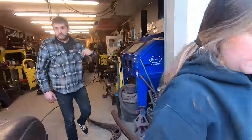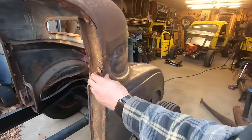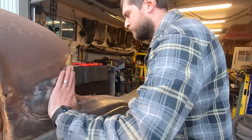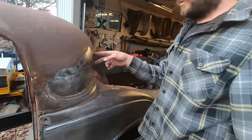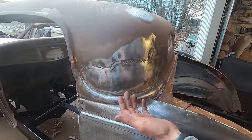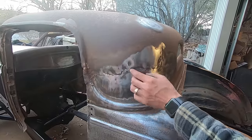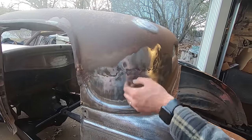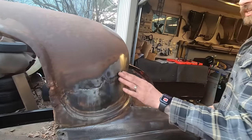Cool. So to air the place out a little bit, because there's rust in the air. But really not bad. Just literally make a strip. I don't have to put any contour in it because I'll just come in with a planishing hammer later and just lightly add the probably 36 to 48 radius that this is. Take 2 seconds.